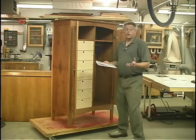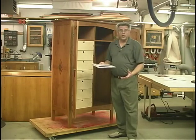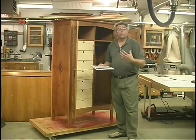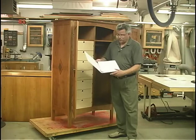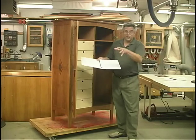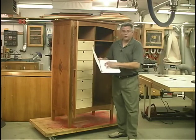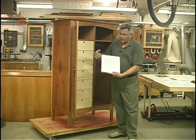When starting on a project of this size, you do want to take a little bit more time and plan it out carefully — that will make the whole construction process go much more efficiently. Now like you, I work from the same drawings. I print them out and then put them in a three-ring binder, which keeps them all together and I'm not finding missing pieces laying around in the shop. The next step: I go through and study each of the components of the project and create a cut list.